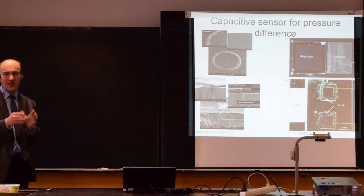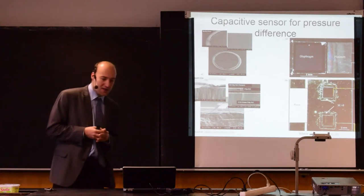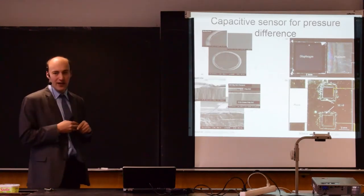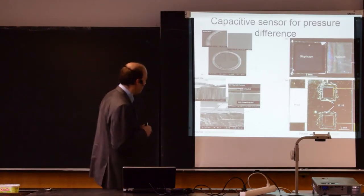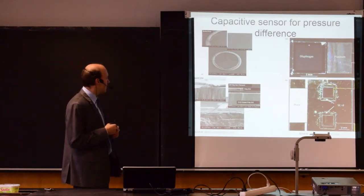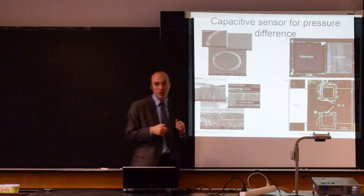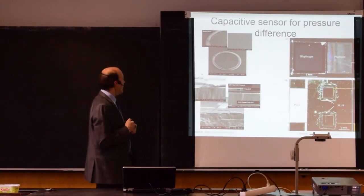So those pressure sensors are used in industrial systems. The diaphragm is either stainless steel or ceramics with embedded sensors from the backside, or it's a chip where the diaphragm is based on silicon. Here you have just some pictures of the silicon diaphragm. Here you see the diameters. So it can be very, very small.